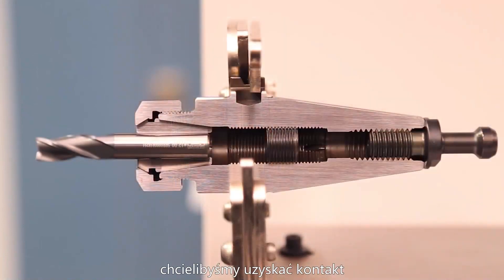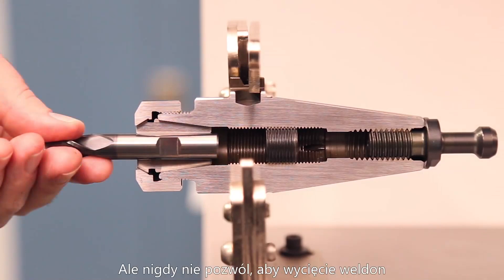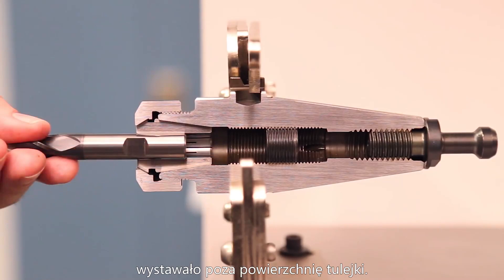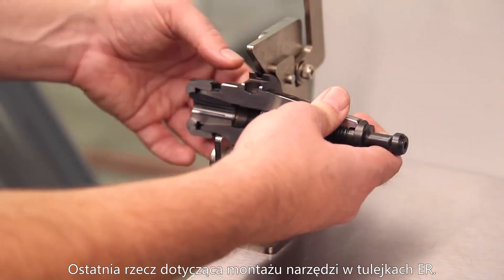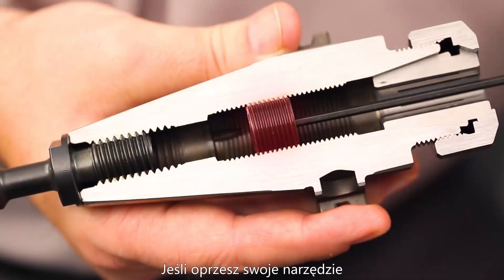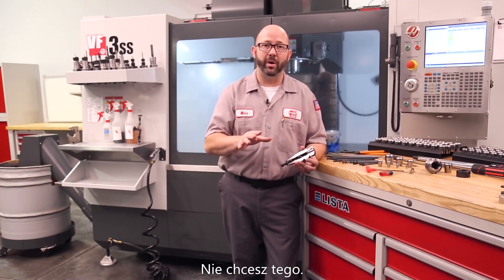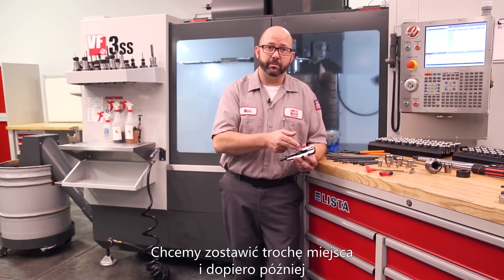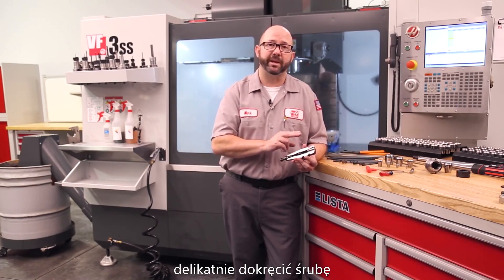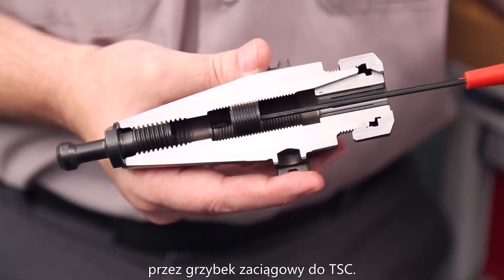When loading up a tool, we want to hold it by the entire length of the collet, or at least two-thirds of it. You can use a tool with a weldon shank but may lose some clamping force — never let the gap in a weldon shank tool hang over the edge of the collet face. If running a drill, never clamp on the flutes. Right here in the center is a backup screw. If you drive the tool all the way up against the back of the holder and then tighten the collet, it could force the tool to wobble and cause runout. Leave some room, then gently bring the backup screw up against the back of the tool if needed.